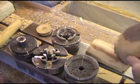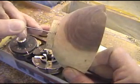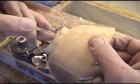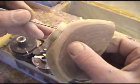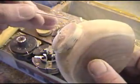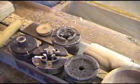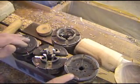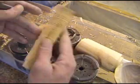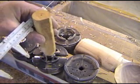Now, on this bowl, as I've turned it before, we can see that I've used the one-way chuck, and we can see the doubles here where the 2 sets of jaws have hit and made that 2 grip factor versus the single half round where we just get out on the tips of that jaw. Any of the chucks will work. You know, if I'm using smaller wood like this, of course the tenon's smaller and the number 2 jaw won't go down that small, so that's where I go back and I use the pin jaw.